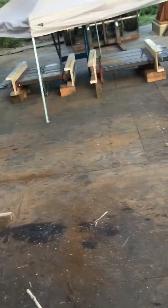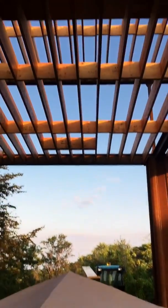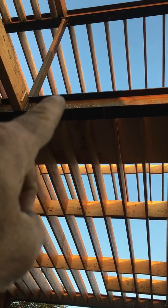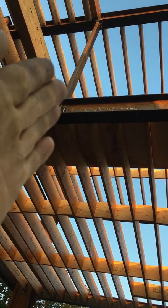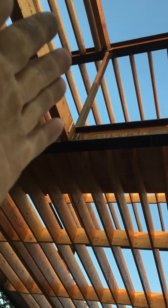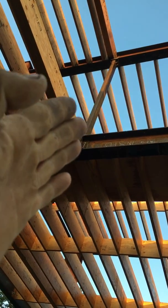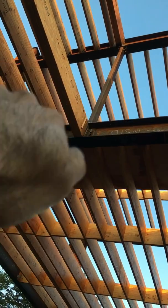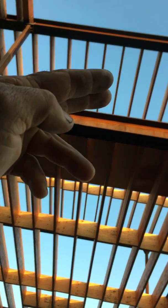To bolt the platforms that we made together yesterday. One platform goes here — 38 inches, a two-and-a-quarter inch space off the bridge so it floats. There's no connection there, it's a gap for drainage, and we didn't want to connect it because it's a floating staircase. Then the stair goes up.